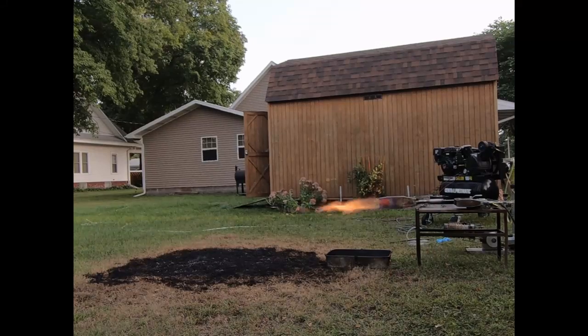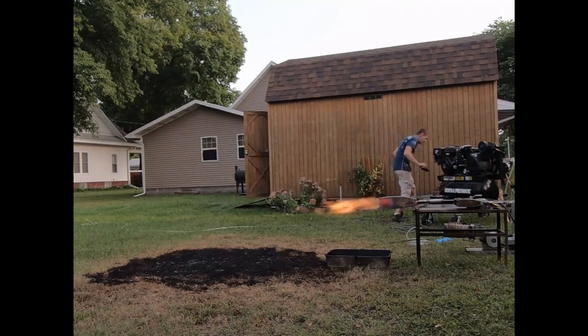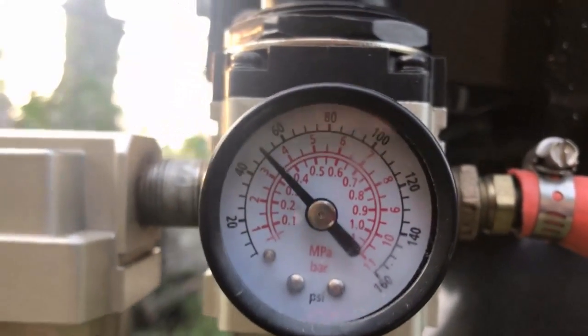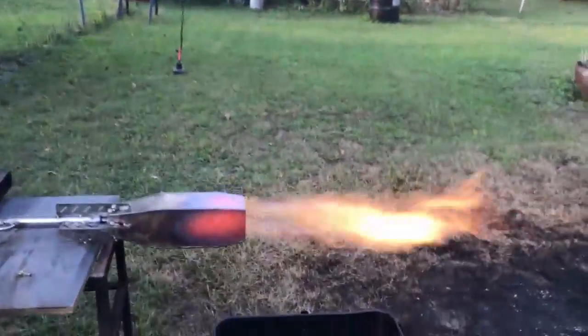Still a substantial amount of fuel blasting into that thing. We're at about 40 PSI on the regulator, which is good. You said the plant air was at 80 PSI. So this whole test was running right around 50 PSI on the regulator here.